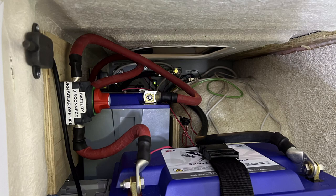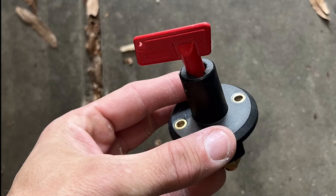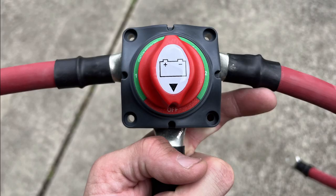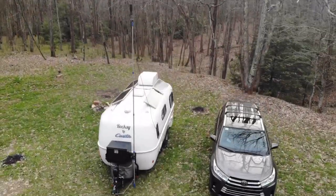Lastly, in order to provide the power from my batteries that the inverter requires, I needed to upgrade my battery wiring. I was running 4 or 6 gauge wires and I went up to 4/0 (four-aught) gauge wires. I also decided to move my battery disconnect from that red key in the hallway that I was always kicking to a disconnect that's closer to the batteries and underneath the bench — out of the way but still easy to get to — and I knew this battery disconnect could handle potentially the 200 amps required by this inverter. This concludes my inverter install. Thanks for watching.